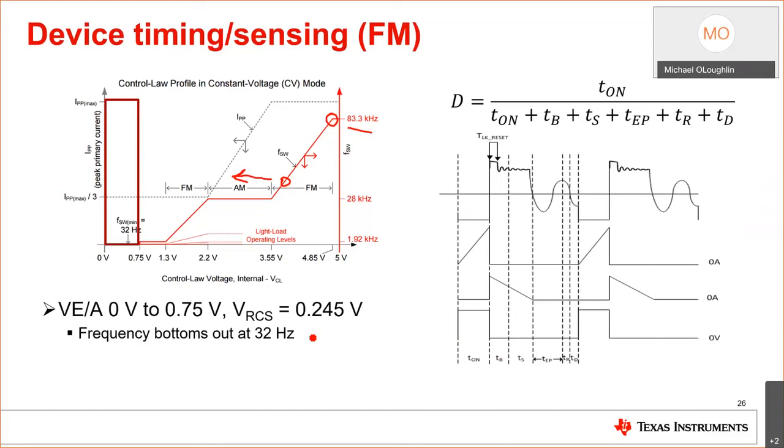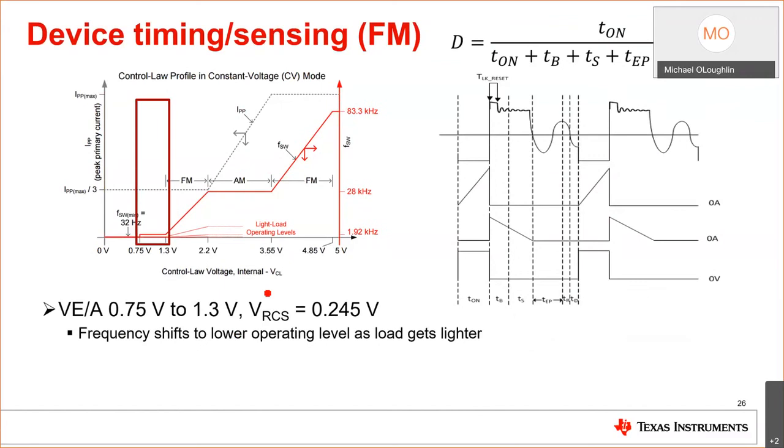I recommended that above 65 watts. So there you have true zero voltage switching. Here you only have valley switching, but that is a much more efficient place than turning on the switch here. Remember, this is a representation of the switch node. We turn on at the valleys. So this isn't as good as zero voltage switching.